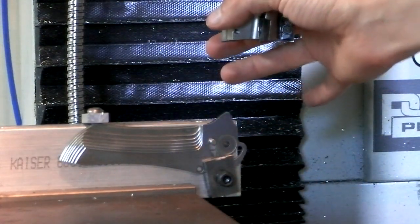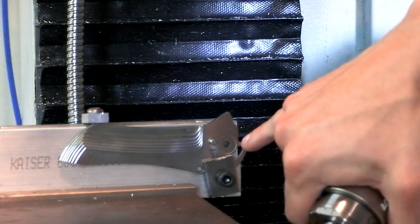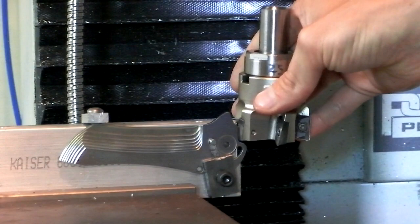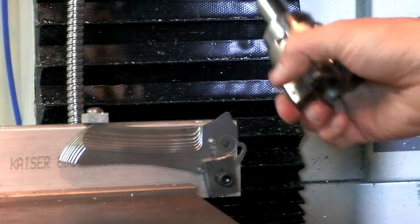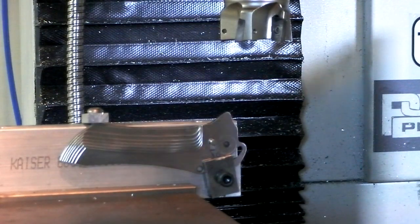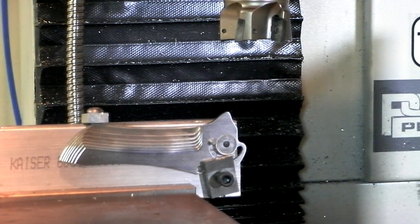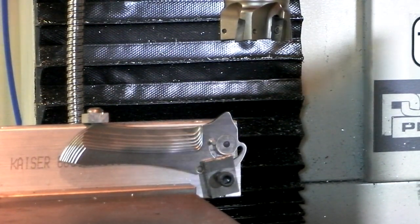So my face mill will basically go — see this little arc right there, it turns out it's too high, so I need to face that off and go that way a little bit. But for the lock bar area I'm just going to plunge it straight down. This is an area where test fitting and doing it over and over again is very important so that the knife locks up properly. You can't just assume it's going to be right the first time. So it basically has to be done one by one — you fit the knife to a set of handles, and from then on they're mated together and they belong together like a match made in heaven.